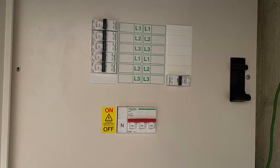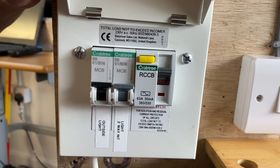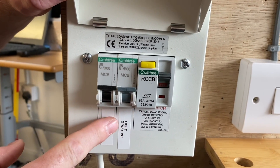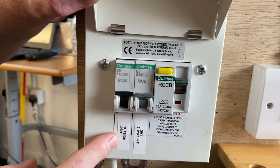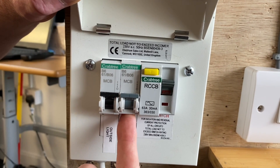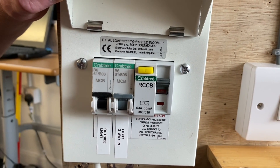In your assessment you're likely to be working in a three-phase distribution board when you wire that single-phase lighting circuit, but here I've just mimicked it with a single-phase consumer unit. As we look in here, the important bit first of all is to identify the circuit that needs to be isolated. The first circuit is identified as 'light two-way and int' — I'm taking that as two-way and intermediate — and the second one is identified as 'outside light'. So I've already identified that this miniature circuit breaker, the MCB, is the one I'm going to need to isolate.